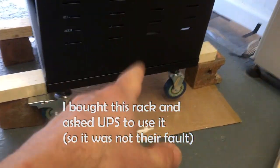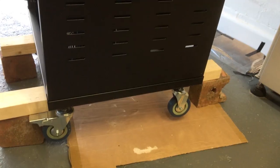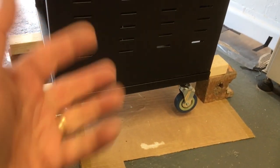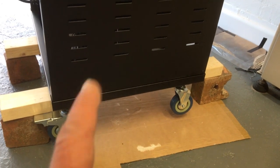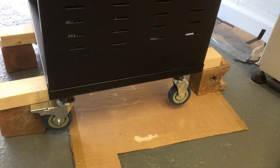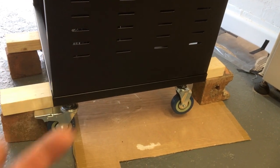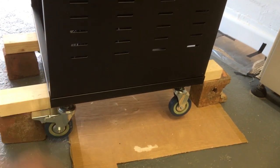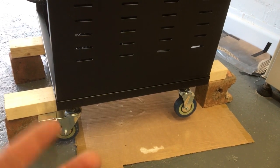This is a lightweight studio rack — it's not meant to have 130 kilos in it. I thought if we're only going to move it a little bit and then it's in place and done, but it's just bent the wheels. Emergency. Luckily they're going to come back in two days' time because of issues getting the inverter and other logistics — which gives me a chance. I've got to get this sorted. I thought I could make a steel angle iron base with some really heavy-duty wheels, machine some bosses, thread them, and screw the wheels in so I can get it level.